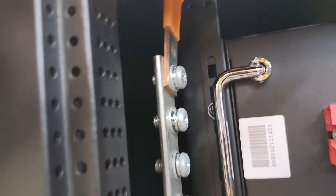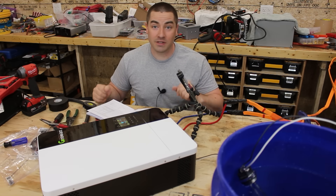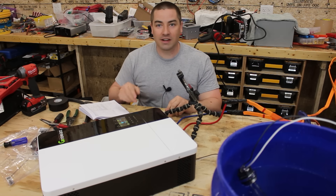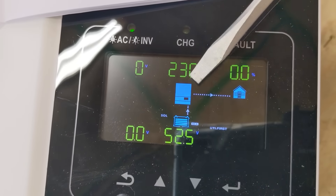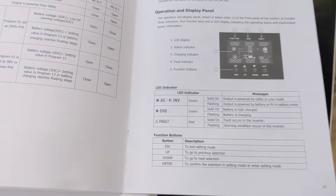Some of you are curious how the connection is made: a big copper strap goes up to the bus bar on one side and across to the bus bar on the other side, giving us our positive and negative bus bars. Looks like the inverter turned on without anything blowing up — that's always a good sign. Now let's go through the menu. The display shows 52.4 volts DC on the battery and 230 volts AC output, currently using zero percent of the 5,000 watts available.